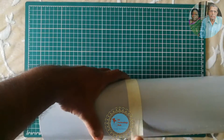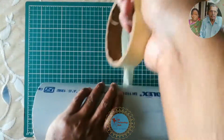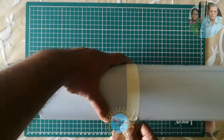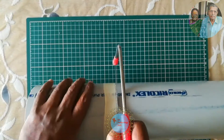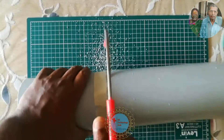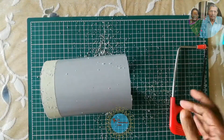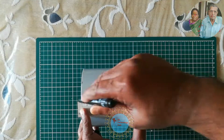To have a straight cut on the PVC pipe, take a paper strip and wrap it around as per measurement. Then take a saw blade or a drill cutter to cut the pipe. You can also apply heat on the line over the pipe and with the help of a sharp knife you can cut the pipe as well. Draw the straight line and cut the PVC pipe.